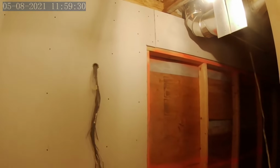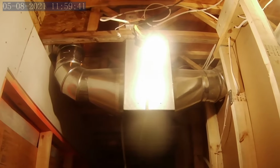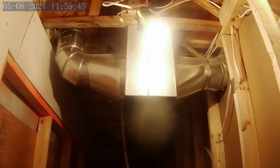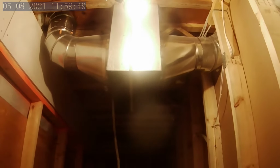Downstairs, we haven't done too much. This is the stairs leading to the basement. This is where the building science lab will be installed. And so we've got that framed out. And we've got the HRV air intake condensing coil that will provide some dehumidification for the incoming air. So again, this area will be left open until after possession, just to allow us to get in faster.